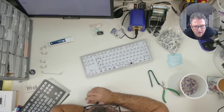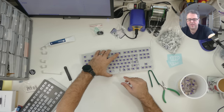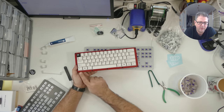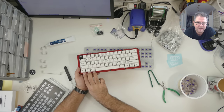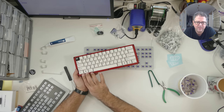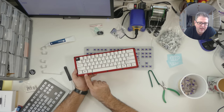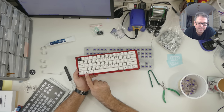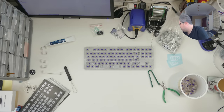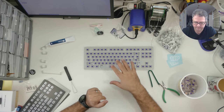Is that space the same as the WASD V2 keyboard? That's what I have at the moment. Spacebar size, I mean. So the spacebar size, JJ, is the standard 6.25U. You'll know that you have a standard keyboard layout if it looks like this, which is three 1.25U's, three of the same size on one side of the spacebar, and then four of the same size on the right-hand side. These four and these three are all the same size. If that's what you've got, 1, 2, 3, 4, 5, 6, 7, then you have a 6.25U spacebar. If you have, for example, a 1U over here, so that these and these three are different sizes, or you only have three on this side, you know that you have a non-standard layout. I'm not sure what your WASD keyboard has. Probably has a standard layout, but that's how you can tell.